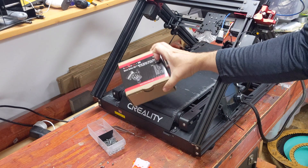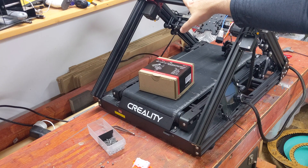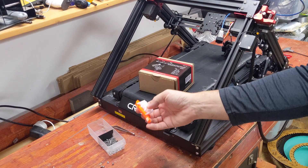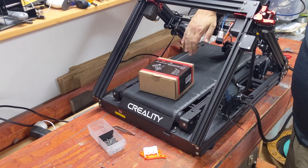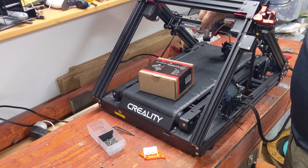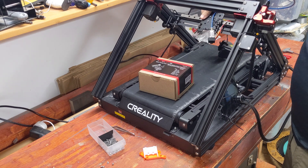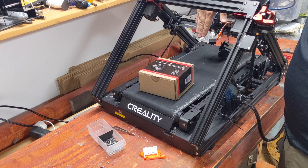This kit is meant for a CR10 or under, so we've got to modify it for this machine a little bit. I'm also going to be adjusting the angle of the extruder from 45 degrees — the extruder is normally mounted at 45 degrees to the bed. I'm going to adjust that to 22.5 degrees so the nozzle is pointing down farther towards the bed. However, we're not going to adjust the 3D print plane at all — the only thing we're adjusting is that nozzle angle.